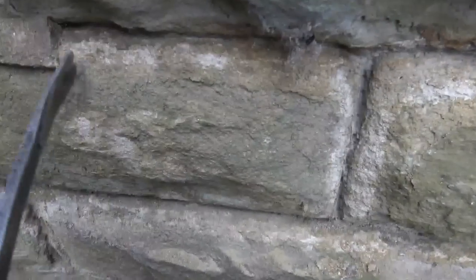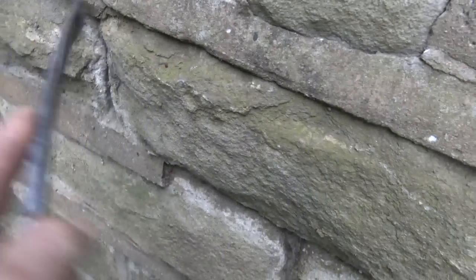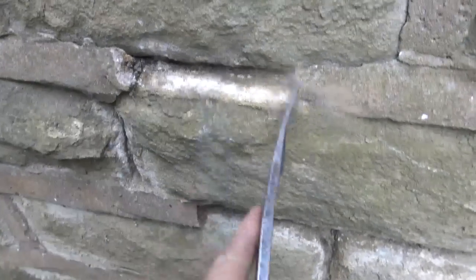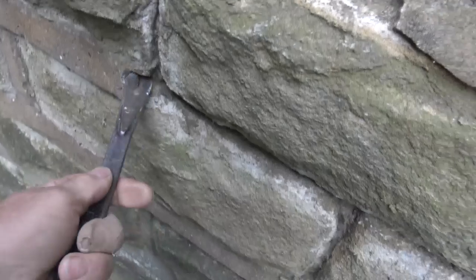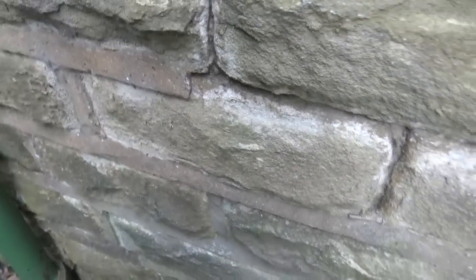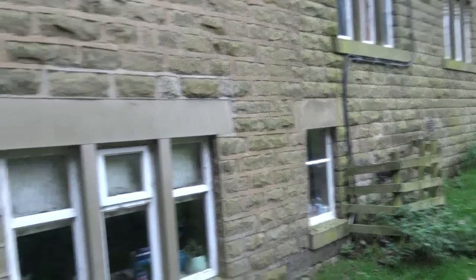Back to here — as for the damage that the cement's doing to it. Just this rapid disintegration and damp. Wet mortar, stonework spalling and cracking. So that's probably the best example I could give anyone of the dangers of cement and cement pointing on an old building. You just couldn't get a better example of it if you tried.